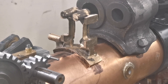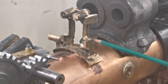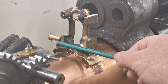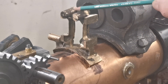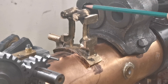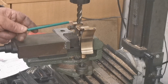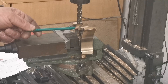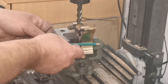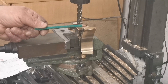Hi everyone, welcome back to my channel. I'm going to finish machining the way shaft bracket. What I've got to do is machine these faces for the slide bars, bore through here for the way rod, and bore through these two places which is for the valve rods. So let's get that set up on the milling machine. I've set the cutter to zero, which is the center of the crankshaft and cylinder from this face here, and the height of the cutter is also set on the center of the cylinder.